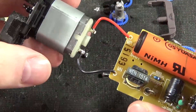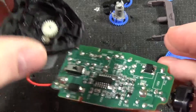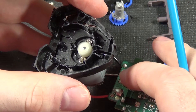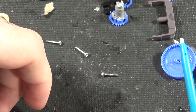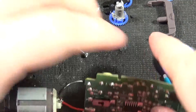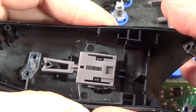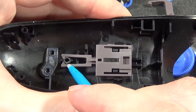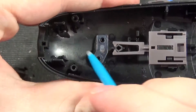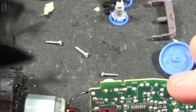Overall, you could almost repurpose this into like a little race car — it's got all the charge circuit built in and directly drives the motor. It screams occasionally once it starts resonating. The plastic molding just has a little click in there, but this switch actually has no click to it at all — it's just a very smooth slide. Your entire click action is done by these teeth grabbing onto this post, and that part moves the lever. You can see there's a little light pipe on the front to guide out the tiny charge indicator light. Very nice case on it — quite impressive.